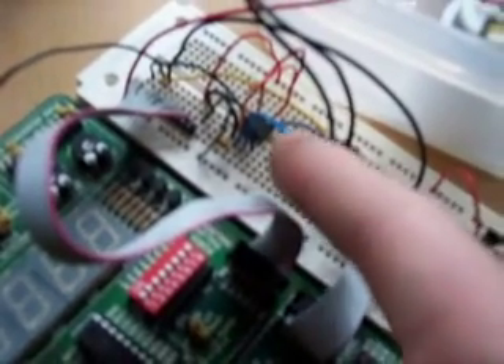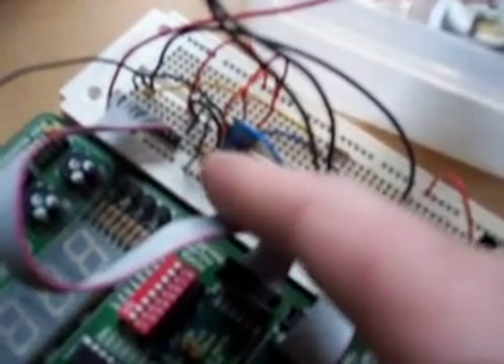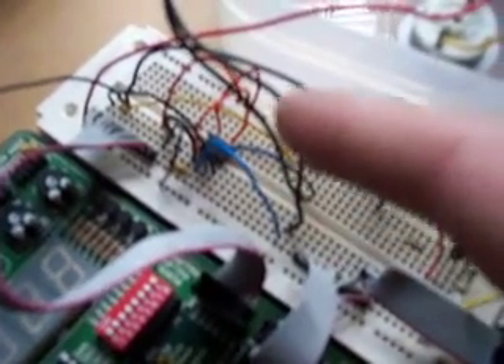In my application that I've written, not only am I sensing water level, but I'm also driving a display, and all of this code was written by me in a modular way so that I can reuse the code that runs the display or the pump. Also buried in the wires is our little 555 timer. Basically what's happening is the 555 timer will create a number of pulses based on a fixed capacitor and a variable resistance, which is the level of our water. Code was also written to count those number of pulses and come up with this number representing the water level.